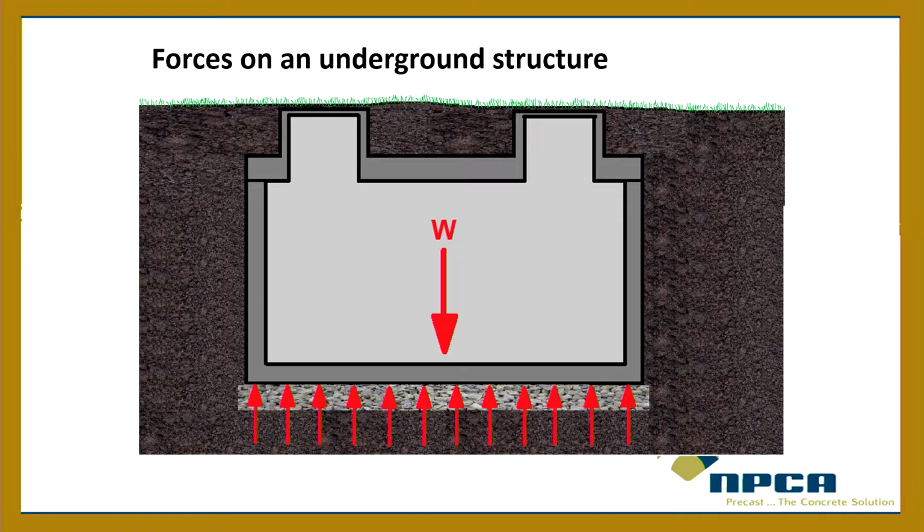Because if we have a big rock under there, suddenly we're taking the entire weight of the tank and everything above it, and we're converting it to a point load underneath, right? So we want to try to avoid the point loads. And depending on the material, that can be more critical sometimes than others, having that one point load pushing in from below or from the side. So that's why we want to try to have something pretty even, avoiding the humps in the middle, on the backfill, or on the bottom, I should say, subbase.